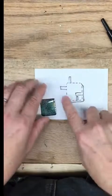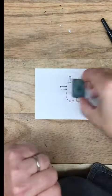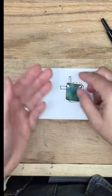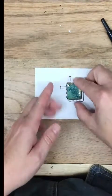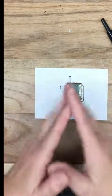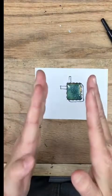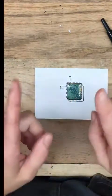If you're looking at this right now and you're thinking, man, that's awful long because enamel is pretty thin. Yep, it is. Not to worry though. After we get to the process where we're actually testing the fit, we'll cut these down to where they need to be and finish them off. I just like to cut them a little bit long because you can always remove metal, but it's pretty hard to add it back unless you solder it, and we're trying to save time, right?